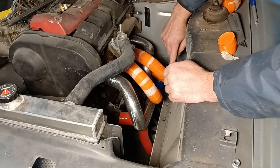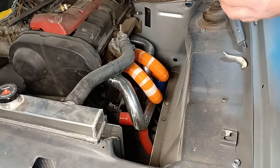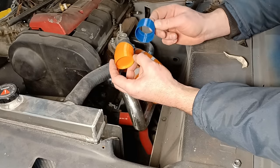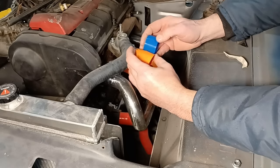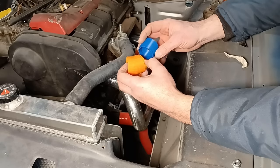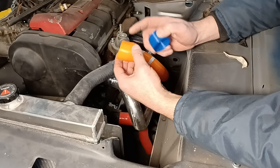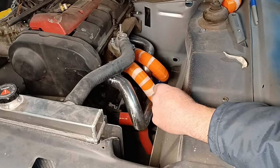Common sense tells me one of these will flow probably about the same as one of these, even though there's a length difference — you've got 25mm there and about 30-35mm on the other. On aggregate that's probably about 30mm in the middle. That's 25mm, but with a slight bend on it I reckon the flow rate needs to be about the same as the straight. So if we can get the number of those and the number of these matching on each of the runs — which we are doing — we should be there or thereabouts in the right ballpark.